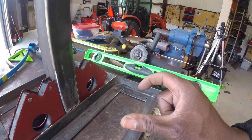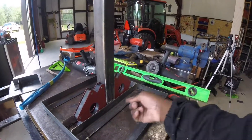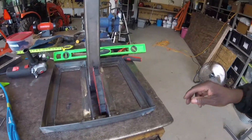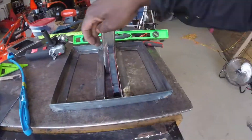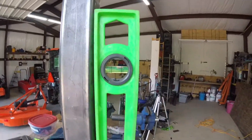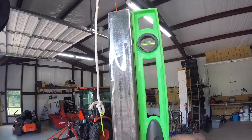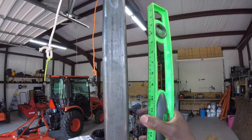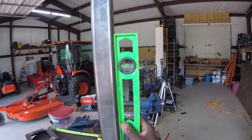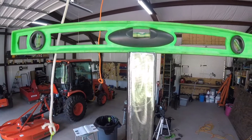I did put the two straps because this is 1/8 thick. I took some 1/8 shims and put them under the bottom of this — I wanted this to be flush with that so when I flip it upside down I can run a bead on each side at the bottom. I'm going to tack it here, put a tack weld on that side, then put one on that side, then come back and run the whole bead — should be able to run one here, one there, and then go up or down. You can see just from the base it's pretty level. I'm going to have to pull it back just a little bit — there we go. It's close enough.